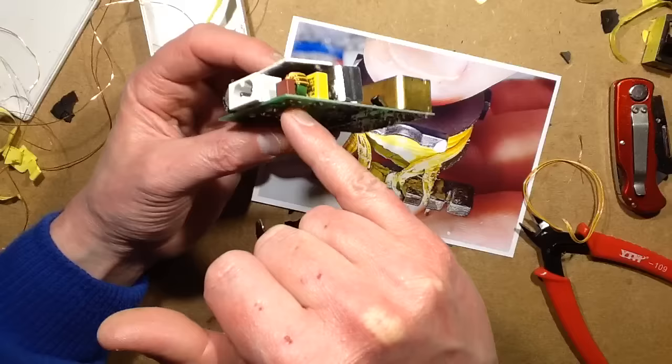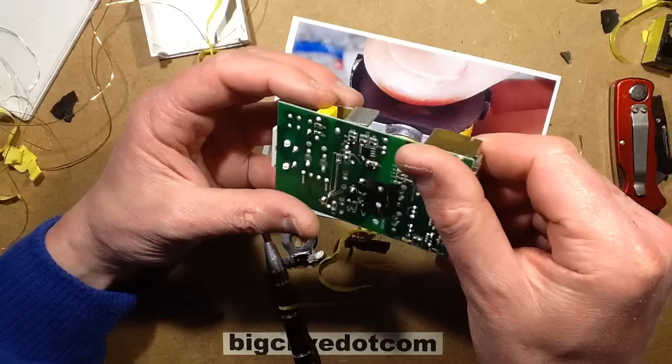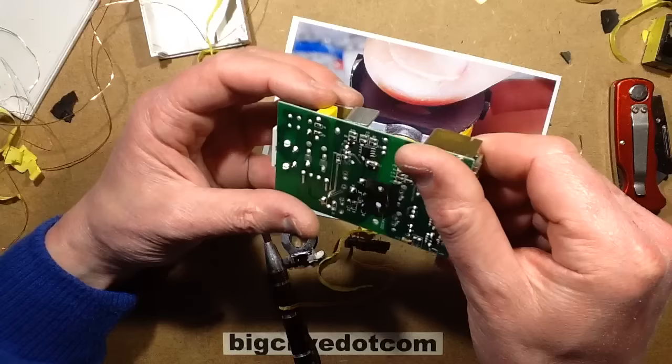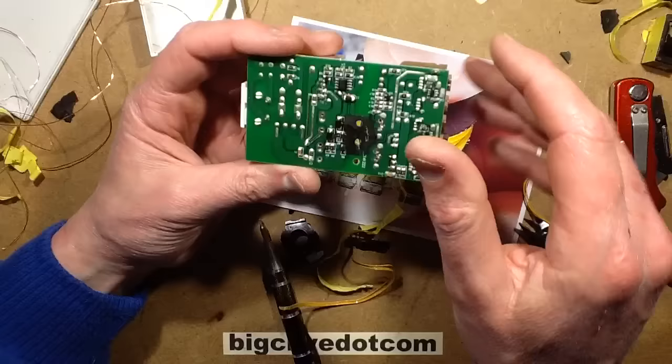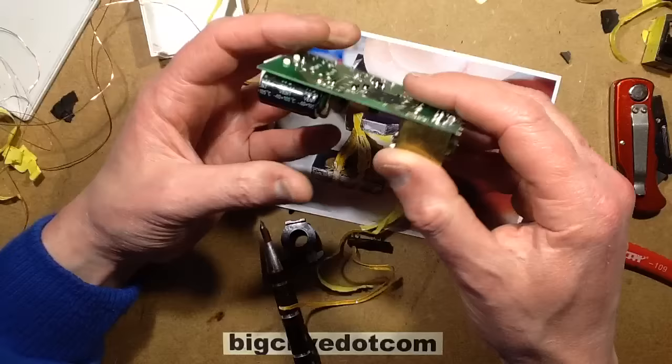The secondary — because it's very high current — is two paralleled windings, each composed of three parallel wires. This is where these small transformers are not so great: with the thick wires there's just so much risk of damage. That insulation looks fairly intact, and likewise the insulation on the primary doesn't look damaged either. That's ultimately all that's left — just the intersection of the primary winding there. My main suspicion then is the feedback winding — connected to the negative — while the primary winding is actually connected to the positive.